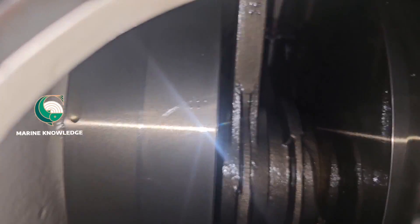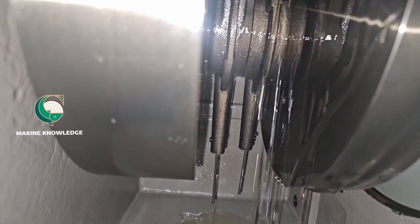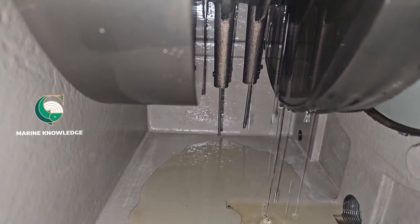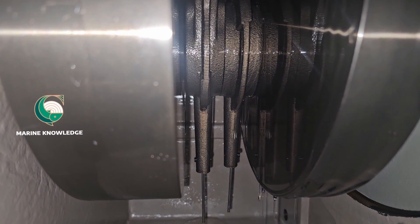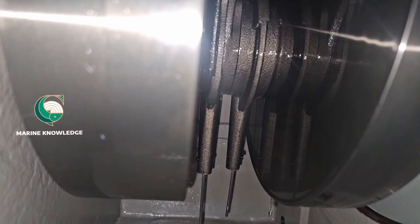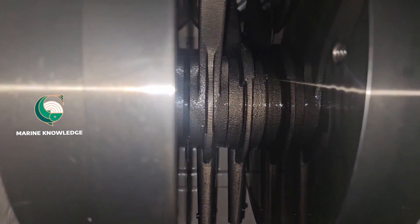Before filling, just use about half a liter of oil to flush it, so that if there are any traces of old emulsified sump oil, they will drop down. Just rotate the flywheel — this is how you flush it. Put in about half a liter to one liter, just make sure it is flushed properly so no old oil remains. Now you can see it is entirely flushed.